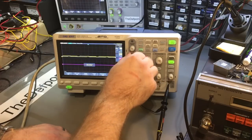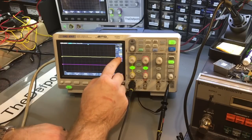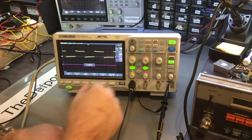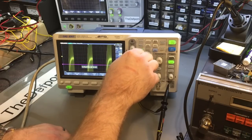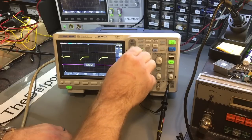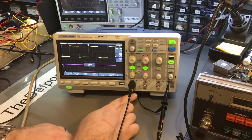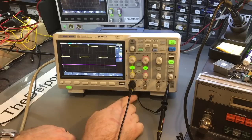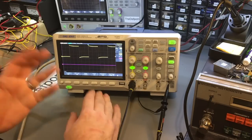Voltage levels. So that is 100 volts per division. I have to actually look, see what the references say it can do. And what's that? 5 millivolts per division. So that's reasonable. It's not too bad. Rating here is 400 volts peak at 1 megaohm. So that's reasonable. It's the levels you expect.